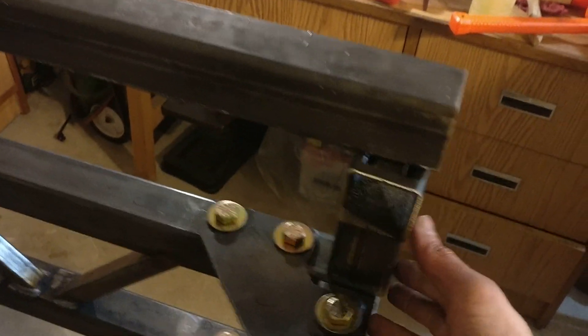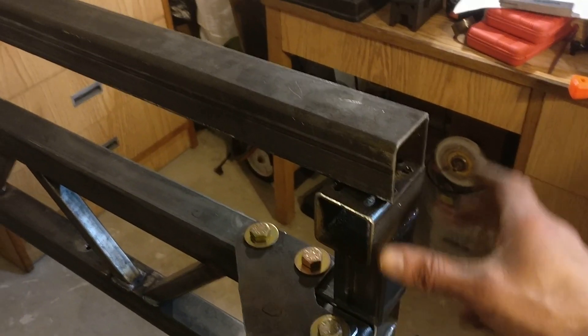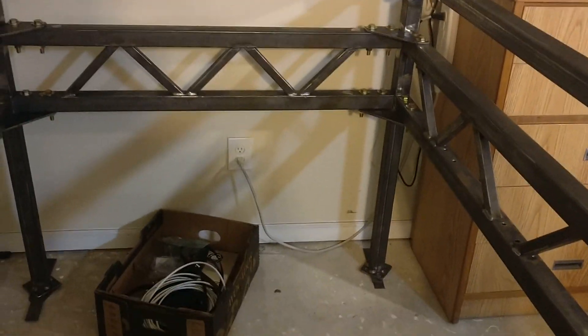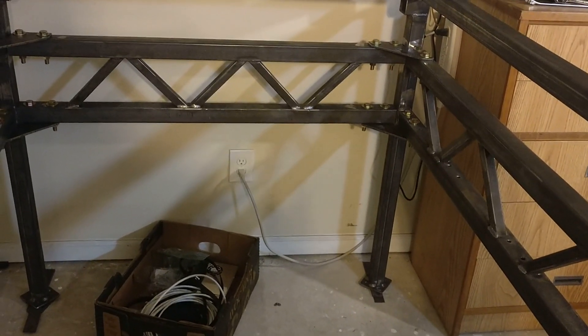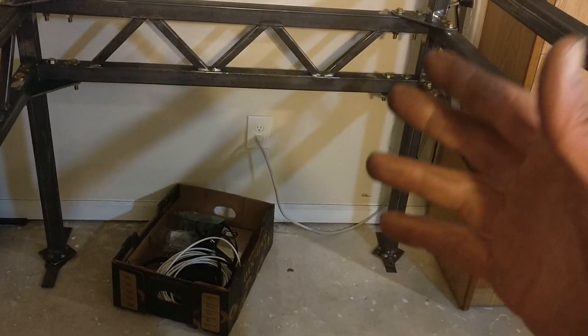The standoffs are 6 inches tall — a 4-inch base and a piece of 2-inch tube, which are 90 degrees. Then you add the 2-inch x-axis on top of that, and that'll put the bottom of the gantry about 8 inches above the top of the table. From what I understand, that's about average, and that should be plenty of room to put a tube cutter or whatever other upgrades you want to put on here later on.